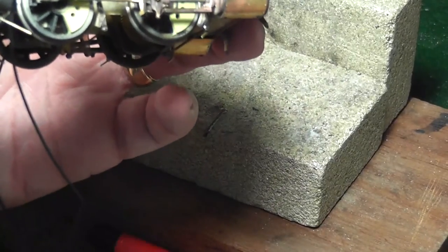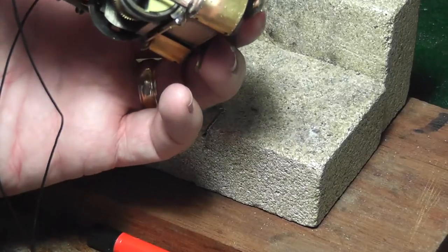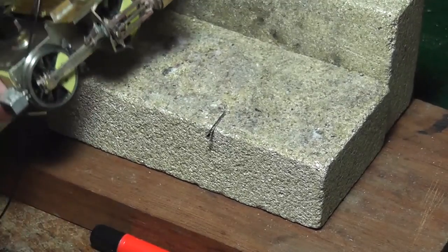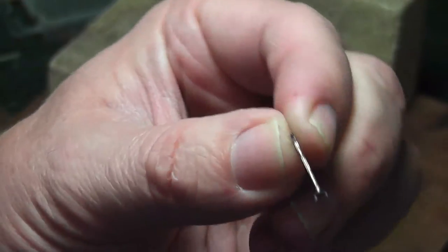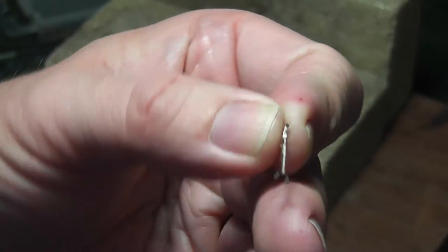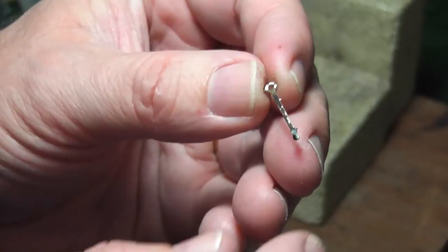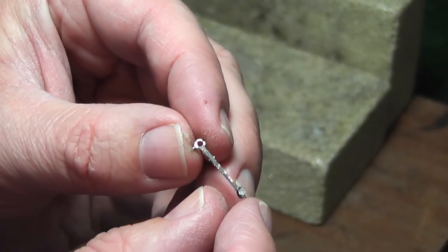The other thing about silver soldering is it flows very, very nicely into the joint by capillary action, and it tends to take much less cleaning up than soft soldering. All the valve gear on this model, which is a Garratt, is in consequence going to be silver soldered. And one silver soldered reach rod link — very easy, very quick. I shall be popping that in the ultrasonic cleaner just to clean most of the muck off, and then just dress up the burrs as you would normally. Nice job done. But much less painful for me than soft soldering.